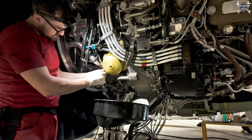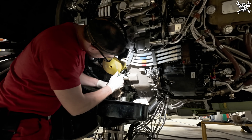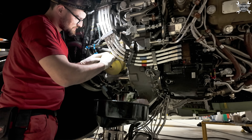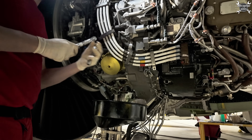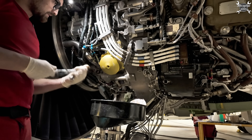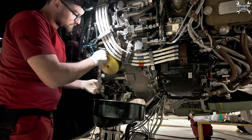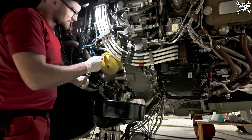Applying evenly distributed force so it will sit exactly as we want it. It's important to say that these are self-locking nuts, so they need to go on hard - that way we'll achieve proper securing. Now we switch to the torque wrench and set the torque value. Once this is done we will install the drain port. Torque value set and we go in a cross pattern - still not fully tight.